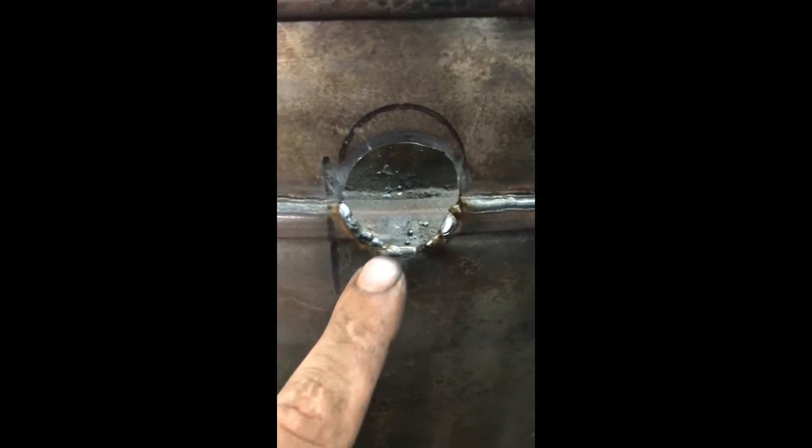Here I've got the hole opened up to size. Now I've gone back through and welded all that metal back together and I'm going to polish it smooth. Back in with the flap disc — all polished up. Come back in with our piece of pipe scrap. I can open up the bottom corners a hair more, but I'm fine with that. That's going to drain really good.